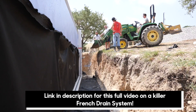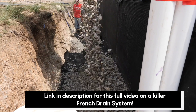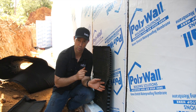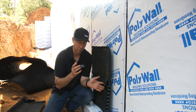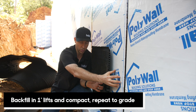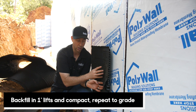This also does double duty. That air gap is going to give us a channel to drain water out and away from the house. It's also going to provide some protection benefits. As we backfill, we need to be really cautious — we don't want to backfill with big rocks — and we want to make sure that nothing is penetrating this critical outside waterproofing. By putting this Arroyo board on there, we're going to accomplish that.